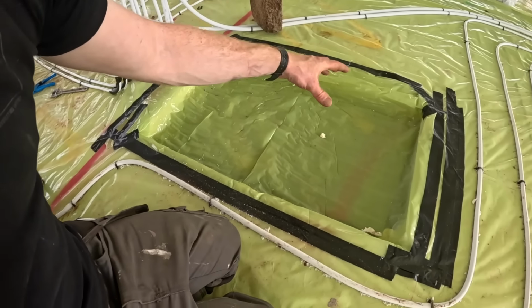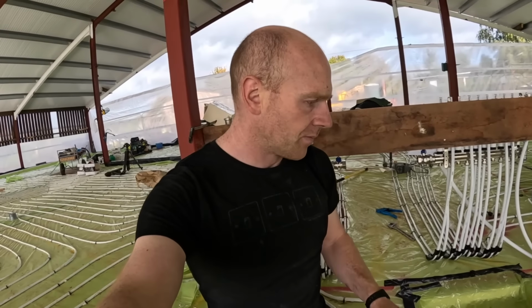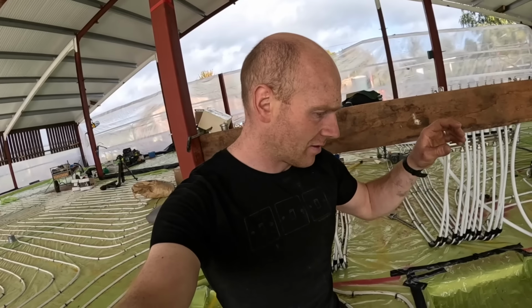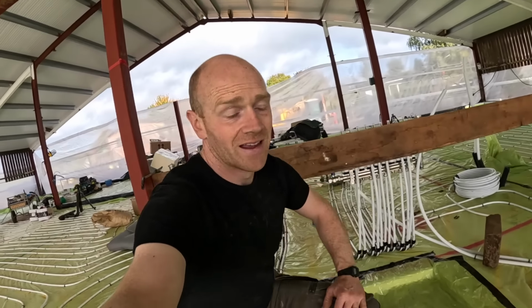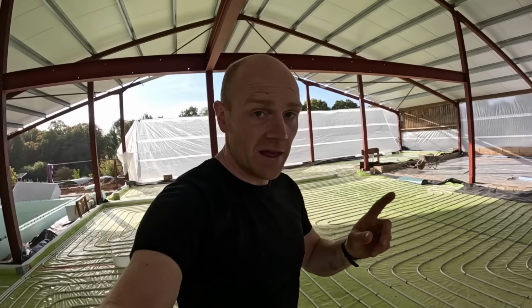And then underneath here is all the well compacted type one anyway. So it was a made up on the spot detail, but it's there. If we don't need it, we don't need it. But if they need to put in some big rebar or resin fix some dowels into the bottom tread, we've got that, and we know that there's no underfloor heating there. It's a very, very substantial chunk of concrete, yet it's not a cold spot. And we've done that elsewhere.